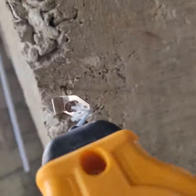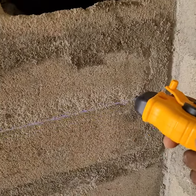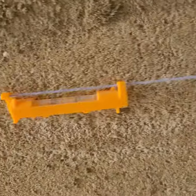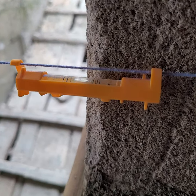I'll release this to this level and drag this down here. So this is the chalk line — I want to take a measurement of this side. This is my chalk line plumb, so I need to make this plumb, adjusting my hands. If I go up, it means it's coming down, so I have to take it to the middle. Move this to the middle of the line. So now let's look at the chalk line — you can see this is plumb.